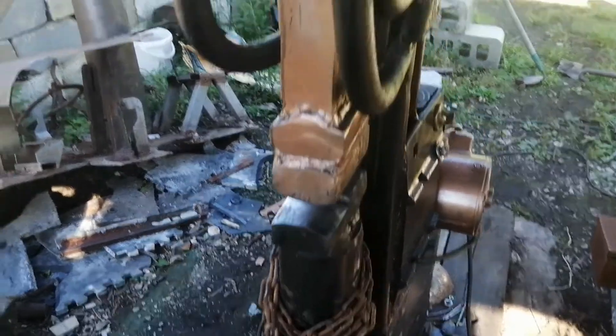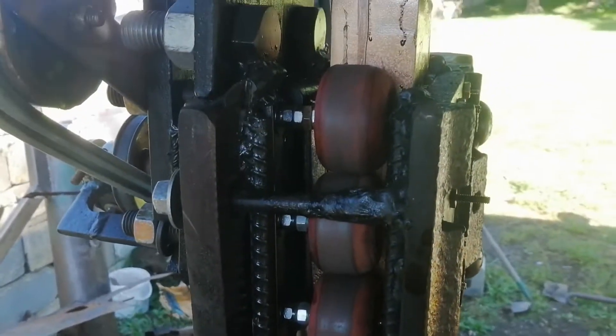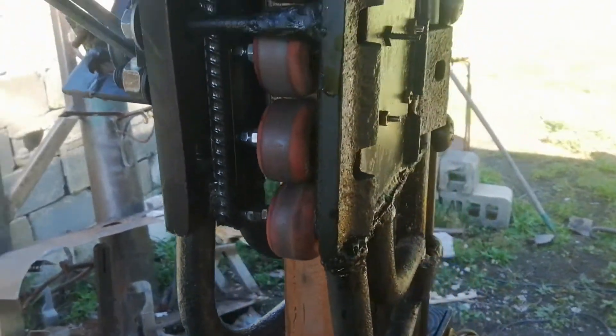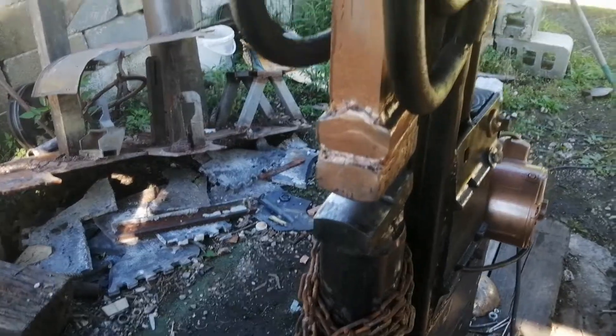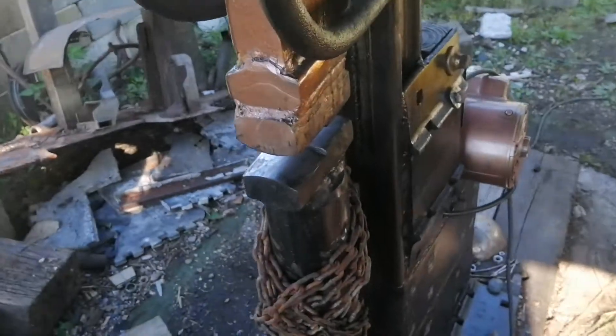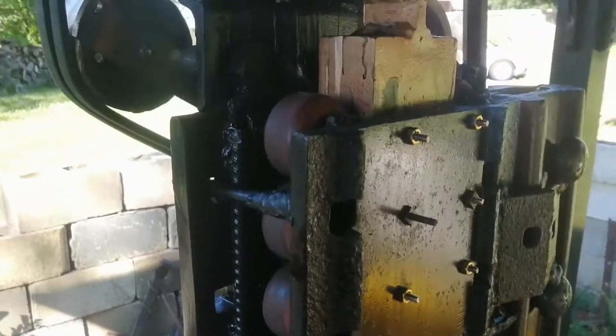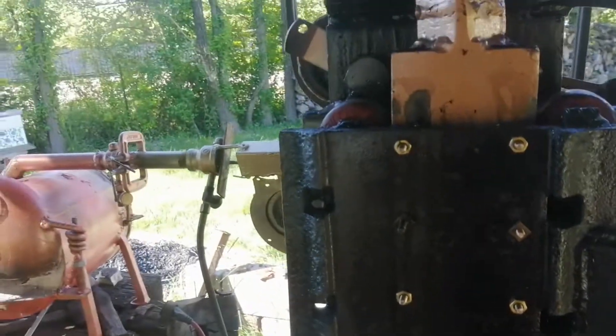With how I have it set up now, the hammerhead is 65 pounds overall with the faces attached. You can see I have it guided with wheels along the side. At first I was playing around with having it guided between brass plates — that worked all right — but it actually moves quite a bit more freely with wheels than sliding between brass plates. I still have the brass plates on the front and back where there's no lateral pressure, but for the side-to-side motion, since the crank pulls from side to side, wheels moved a lot more freely than the brass plates.